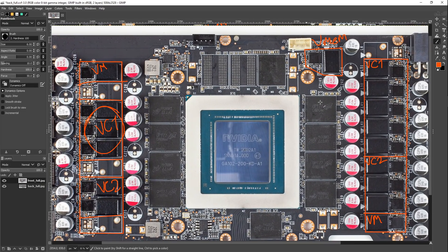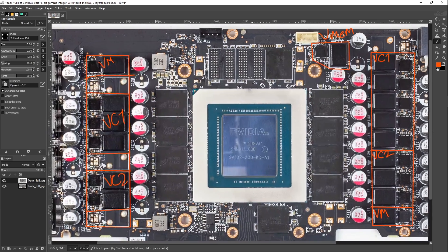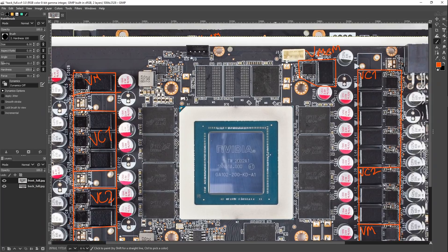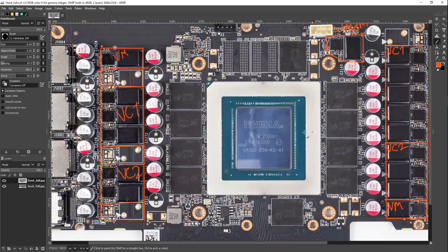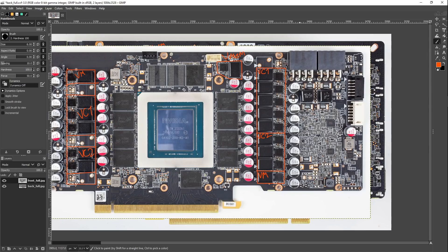There's a similar idea behind having VCore coming into the GPU core from both sides — you have VCore 2 on either side of the chip. We already saw this with the 2080 Ti, where you had VCore power delivery on both sides. Vega kind of does it with its L-shaped VRM, the Radeon 7 had a U-shaped VRM which was the peak of mashing power into the chip from every direction to reduce power plane losses, and the Titan V had VRM on either side of the chip. This kind of layout is just better for power delivery, though it does make the board a bit of a mess to look at.